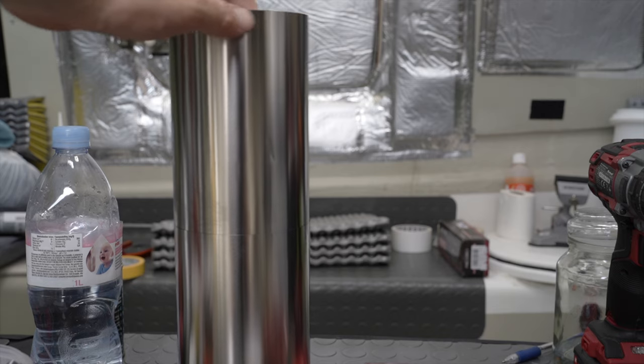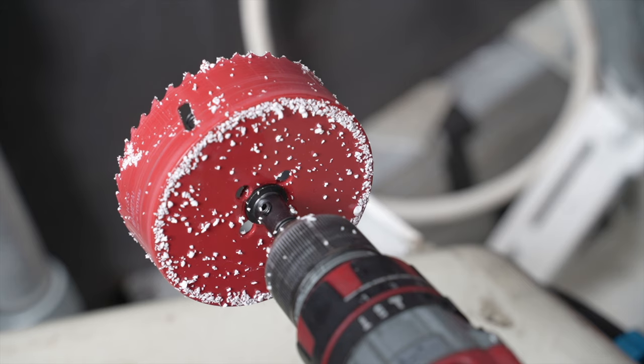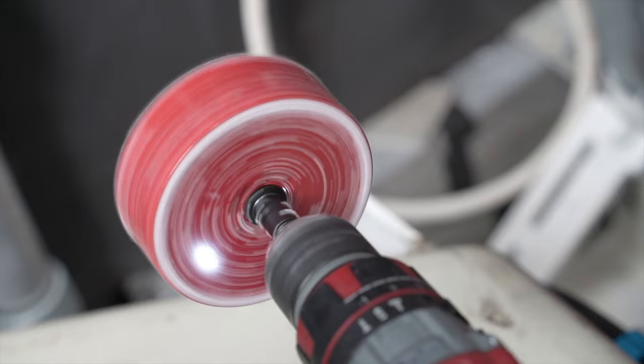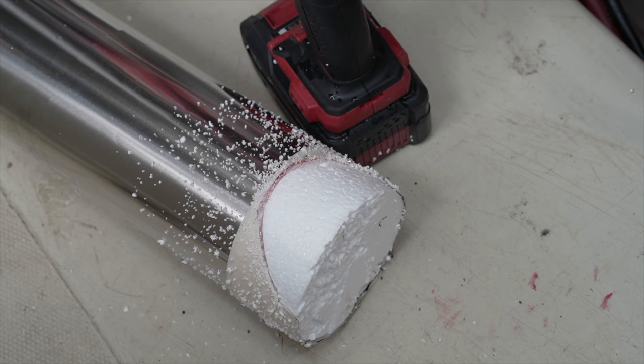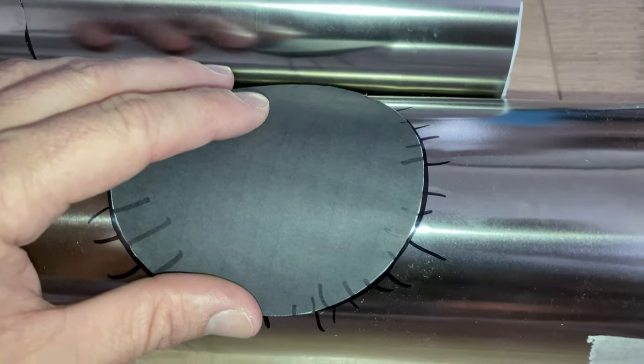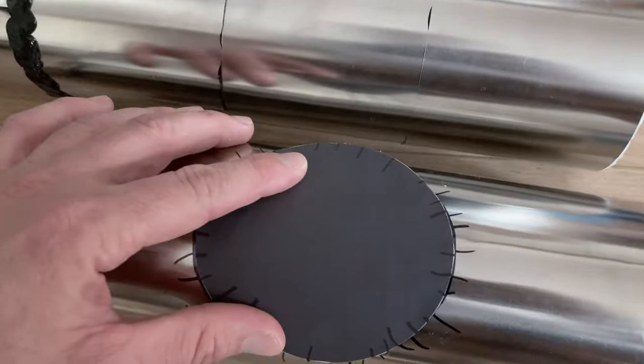Now the first of the tricky moments of jaw-dropping innovation and artistry. To fit the sections together, they need a 100mm circular cut made in the ends. It was a little messy, but I was relieved when the drill, on a high-speed setting, cut through the steel without grabbing or snagging it. Some tightly wound masking tape strapping helped. Using a paper template and a sharpie, I could mark on the midsection holes to cut manually as well.